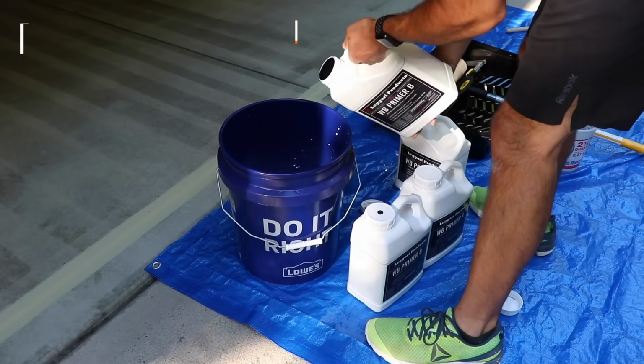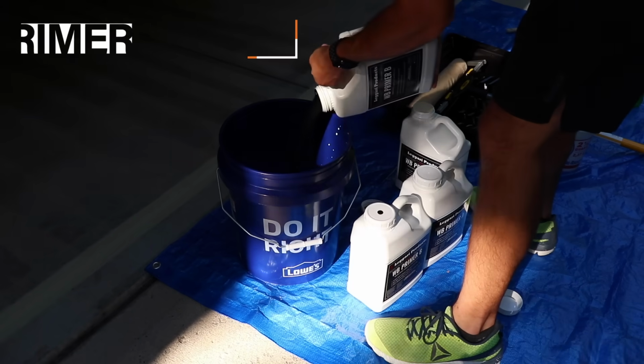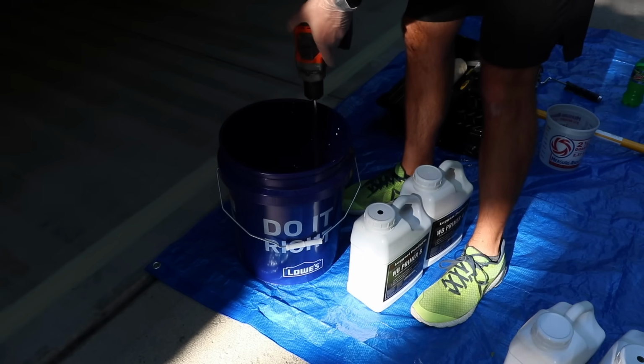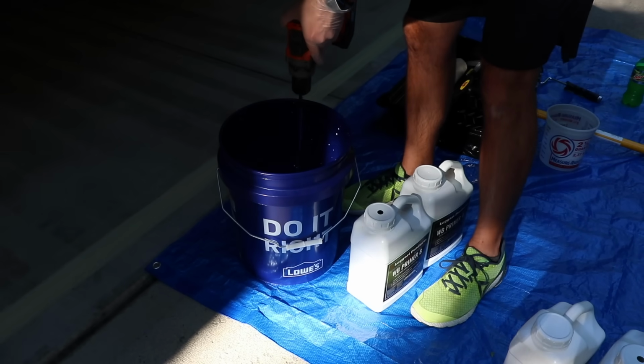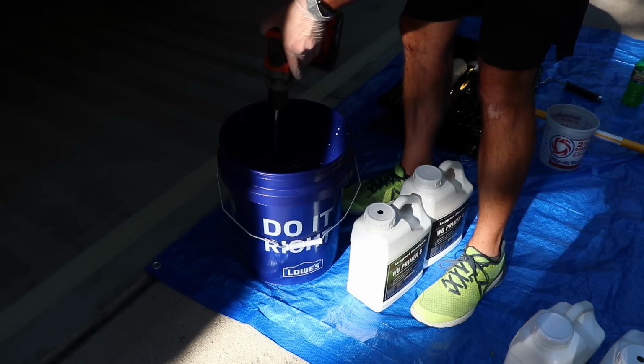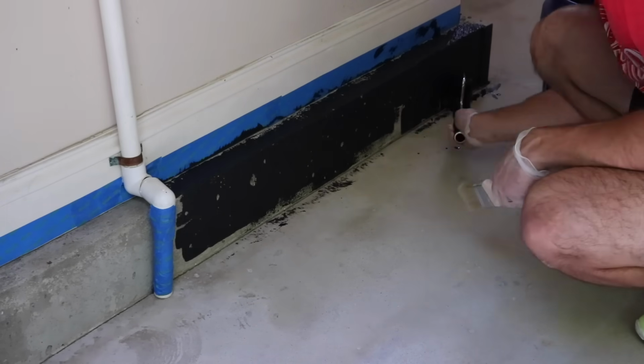So the first coat is actually a primer. It's a relatively thin coat that's going to give the epoxy something to really bond with. Now you won't find this step in those cheap big box store epoxy kits. All of the Leggari products, whether it's primer, epoxy resin, or the urethane top coat, come in really easy to handle containers and makes mixing the right ratios a breeze,